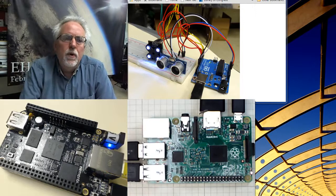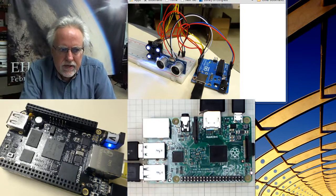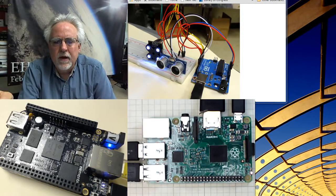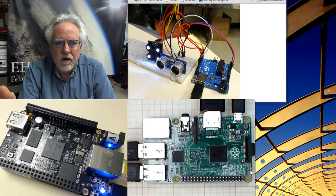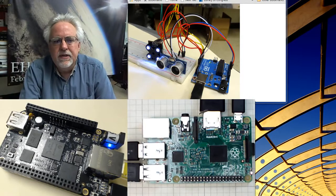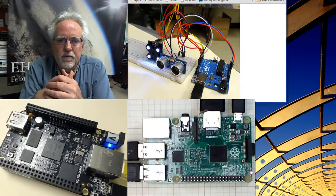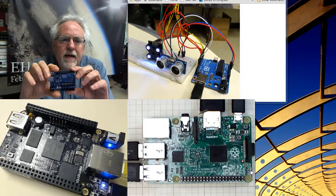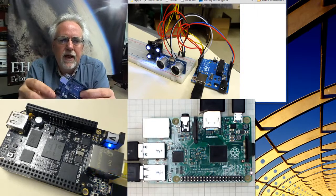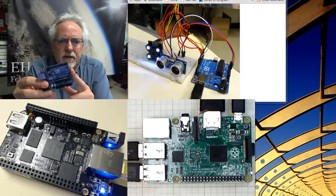At that point, I could not use the Arduino, because to do the GPS, you had to load the GPS library. To do the SD card to log the data, you had to load a library, and then the pressure sensor had a library, plus the code that you were writing to make everything do what you wanted to do. By the time it added all up, there was not enough memory, and I was simply not able to add any more components to my projects. And so at that point, I was sort of shut down.